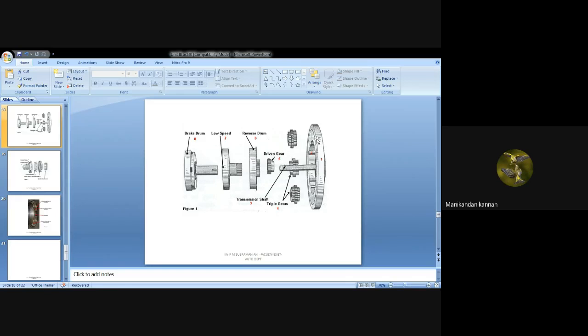This one is the flywheel. We are having a flywheel and a transmission shaft connected to the flywheel. We are having three planet gears, and these three planet gears will be having triple gears — meaning three rows of teeth — for obtaining different gear ratios. So three planets, and in each planet we are having three gears.